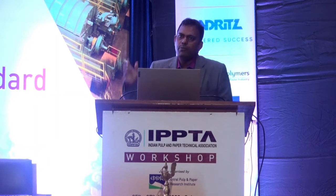Because if you have the washer in the last stage, what happens? You take 10% to 12% consistency, but you are not able to use this D0 filtrate water for diluting the pulp. Then that will go back to the drain. So whatever residual chlorine is in the effluent will go to the drain.